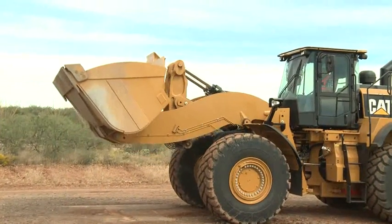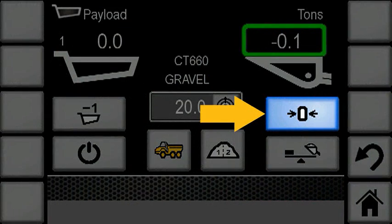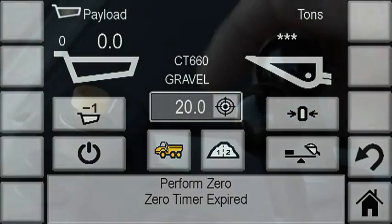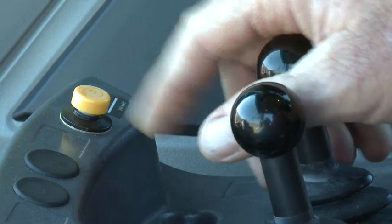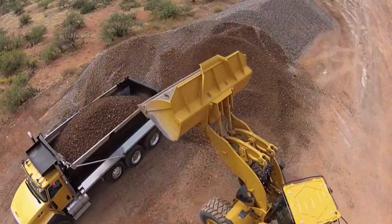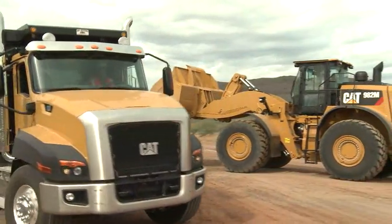Use these steps to perform the Simple Calibration. Step 1: Zero the bucket before beginning recording loads. Step 2: Load and store the payload on 1 to 15 trucks that are also to be weighed on another scale. The more trucks stored, the better the calibration will be fine-tuned.